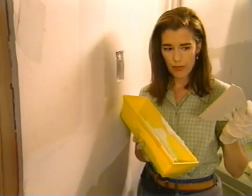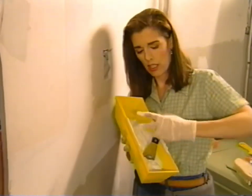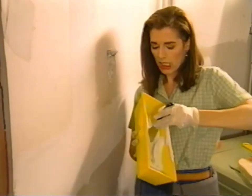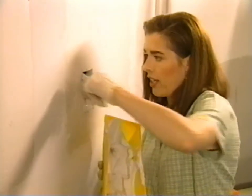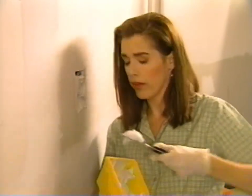I'm going to start with a knife that's far too wide for the job, so let's get a narrower knife because I want to just fill this hole with as much as I can. This stuff shrinks too — pre-mixed drywall compound shrinks a bit. So you'll get lots of practice because you're going to have to come back and fill it up again when it's shrunk and dented a bit.